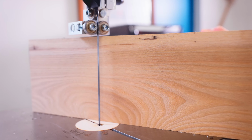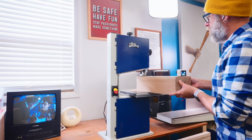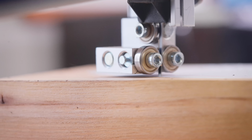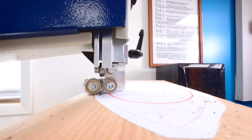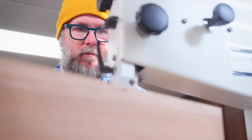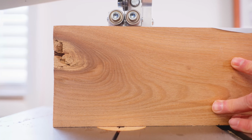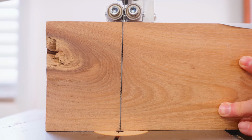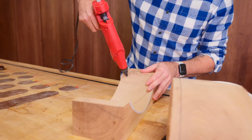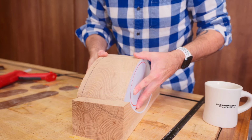So I drew up this football eyeball shape in Adobe Illustrator. It's not meant to be a football or an eyeball, it's just what came out of me at the time. So I'm attaching that printout to the top of the board and cutting out the outside shape on the bandsaw. The trick to cutting thick wood on a small bandsaw is, one, you need the right blade, link in the description, and two, cutting slow. Give the blade time to remove the waste and cut just outside of the line so we can sand down to the line in a later step.